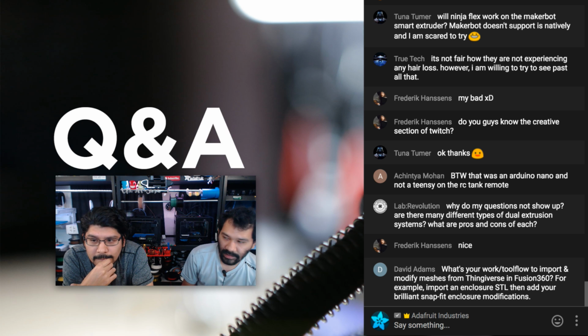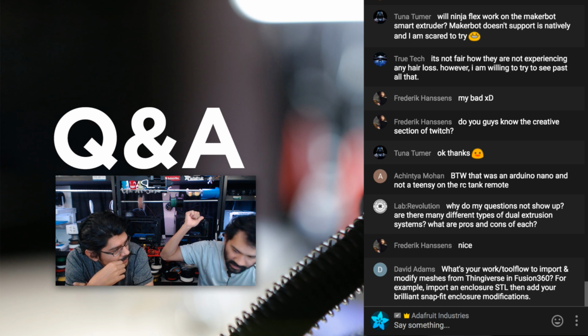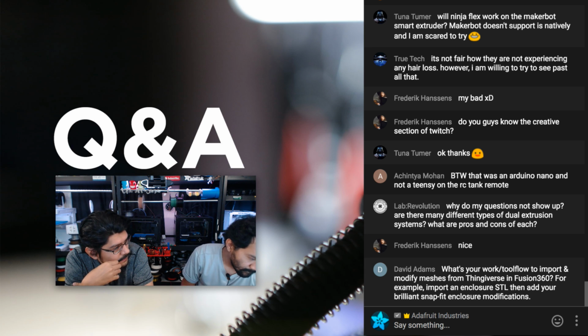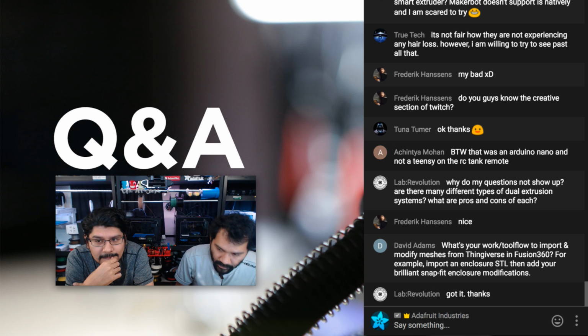The cons of having it together is you have contamination. Calibration. I don't know how to write code to make it have one of them cool down while the other one's doing some printing. You have to write some serious G-code. Yeah, the Ultimaker does that actually. Yeah, it cools down, but it also retracts it too. Yeah. And then the Sigma has a purge system. It moves all the way to one of the sides, parks it, and then has a little wipe nozzle to get rid of any oozing. So yeah, that might warrant a video.